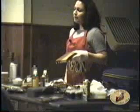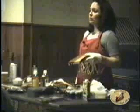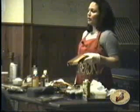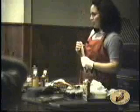You said wax there. Mm-hmm. If you use wax, won't it also not give the highest sheen? Well, you can buff it. You will have a sheen. I mean, your French polish is still showing through. Your wax is really protecting it.